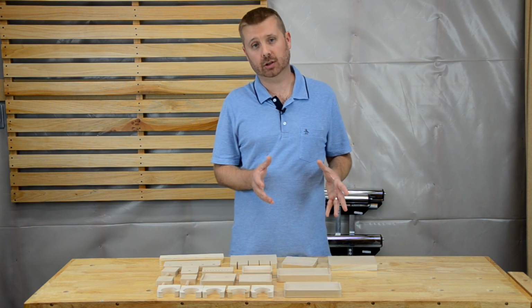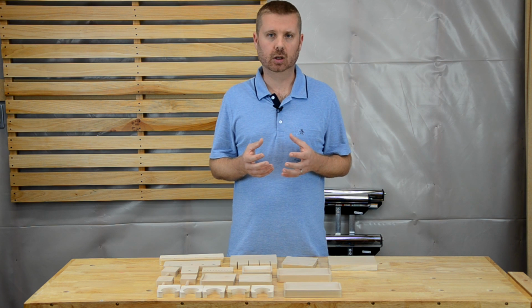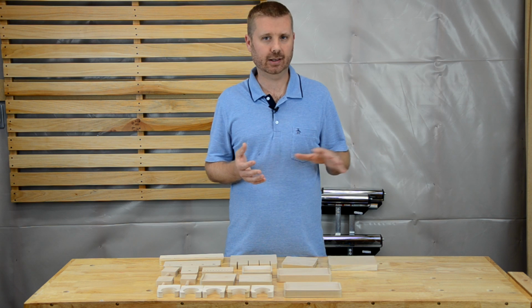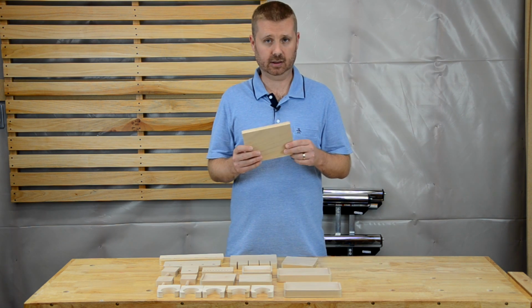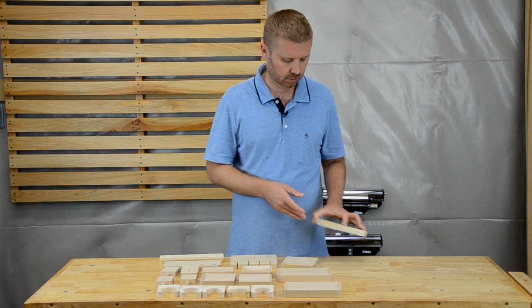When you go select your lumber, try to avoid the pieces that have that predominant green to them. Shoot for the boards that have either no green or have a uniform green tint throughout the whole board. You know, kind of like this. Has a green tint, but it turns into a very nice color after you apply the acid.